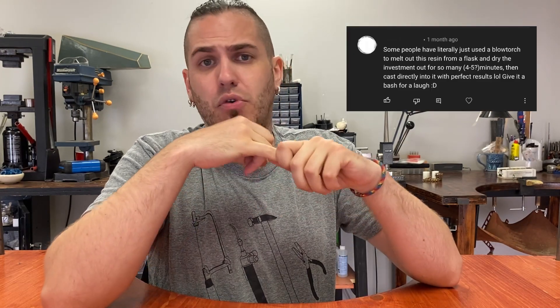You need to put it into a proper kiln. No matter what anyone tells you, casting is a science — you're trying to create an ideal environment. Don't assume that you can throw a gypsum bonded flask like PlastiCast or something into a 2,000 degree kiln for four hours, or stick it in your gas forge if you're into blacksmithing for an hour, or put it in your home oven if you've got an extra one. Don't try to melt your metal in the same furnace that you're doing your burnout in, or just try to hit it with a big torch. There's a lot of things that need to be done correctly, and none of those are really great options.